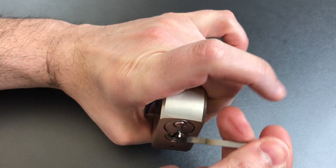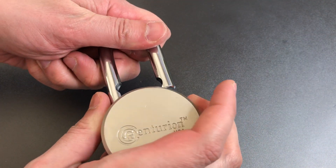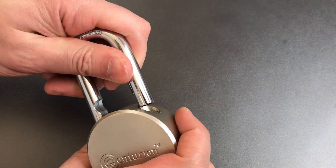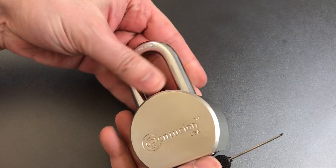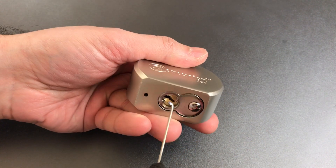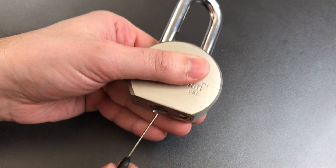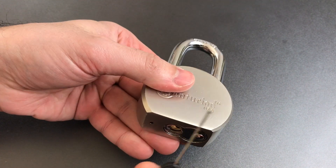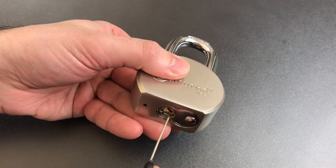There may have been some spools in there — it was really hard to tell. I did feel like I had some counter-rotation, so if they were spools, the spooling wasn't very sharp. Before we take it apart to check, I wanted to show you one problem with this lock, and this is a big problem: it can be bypassed very, very easily. There's no anti-bypass wafer, and the actuator is of a bypassable design, meaning any one of these Centurion round-body padlocks can be opened as fast as if you had the key if you have a tool like this.